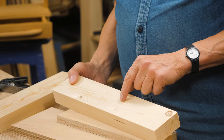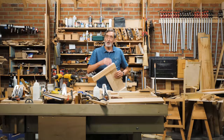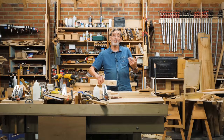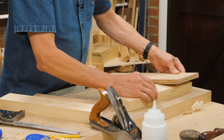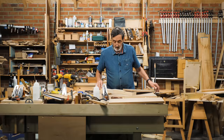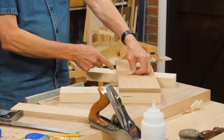I've got this square mark on here — these are my two registration faces. This is a left and right hand version. This is only for squaring end grain, not for doing mouldings and things like that. You put it in the vise this way and plane that way. Turn it upside down if you're left-handed or if you need to go in the opposite direction. This long edge has to be dead square to this edge, so we're going to use the square on this edge to square everything up.